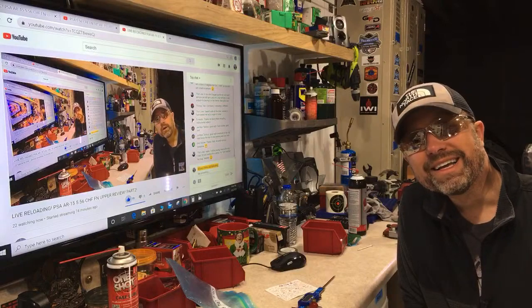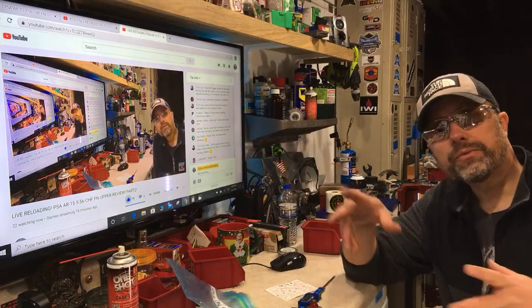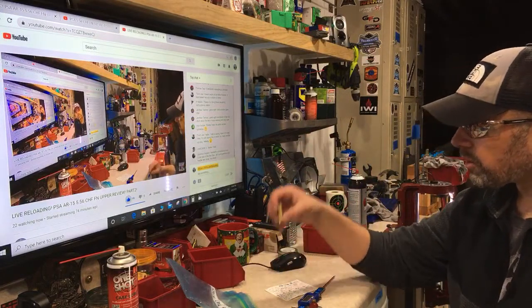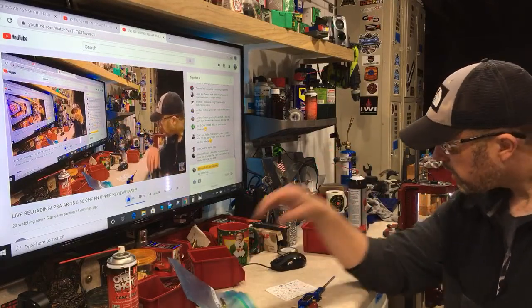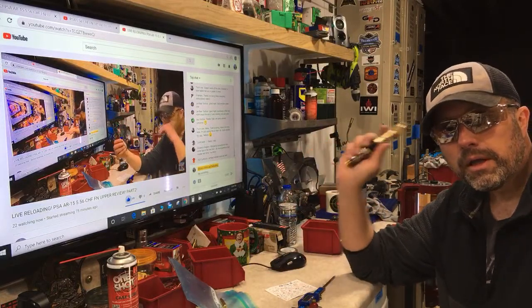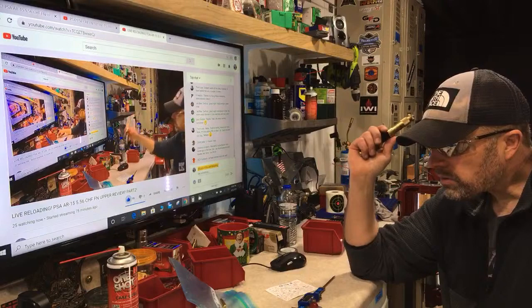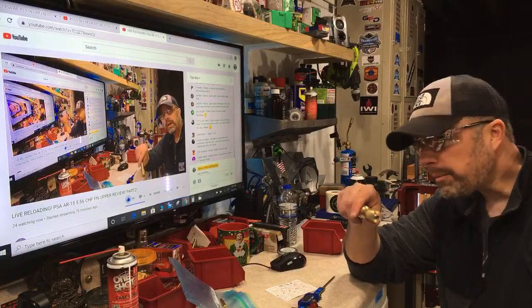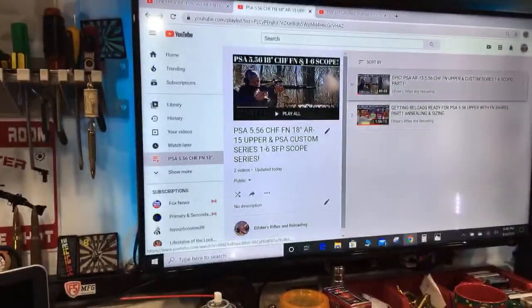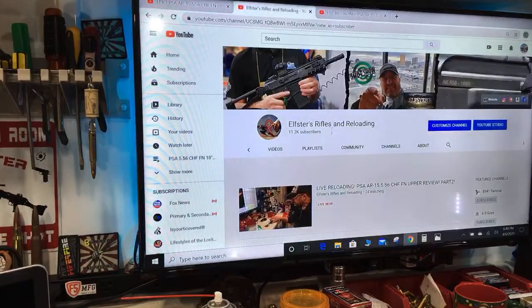Like I said, either you love it or you hate it. But right now, we are up to sizing brass. And if you're new to the game, this is the first video we watched. Obviously, in order to get to this step, you're going to have to pop out that primer with some type of decapper, get it into the wash, or at least clean the brass in some method, dry it, get it back out, and I would usually anneal at that point. If you have no clue what I'm talking about, check out the playlist area of my channel. And if you're absolutely new, go to the playlist area.